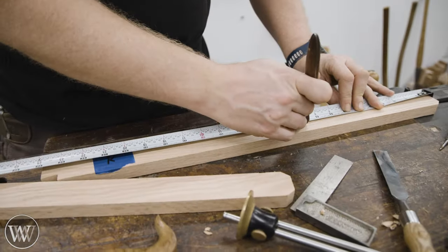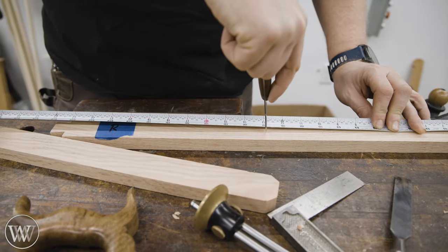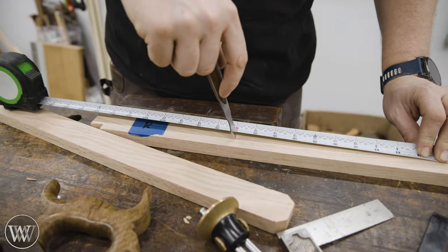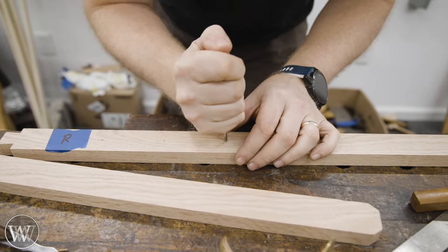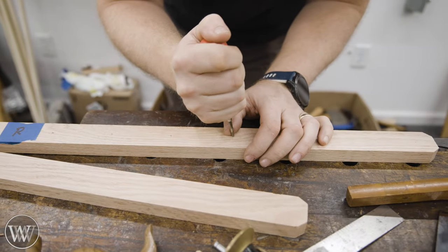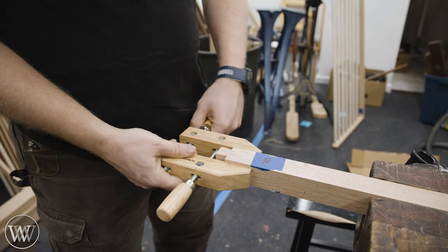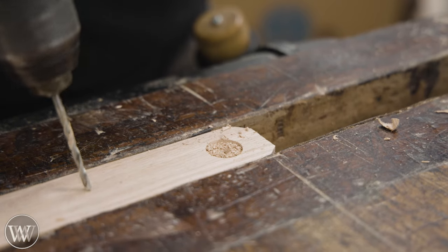Making them look pretty. Then we're going to make marks along these boards — I'm putting them at three inches apart. That's what my wife found she liked to work with. You might like three and a half; play with it and see where you want them. I'm going to put a little dimple at each mark at three inches down the bar. I'm only going to mark one of the two bars because I'm going to stack one on top of the other, clamp them in place, hold them in the vise, and bore holes through all of them.